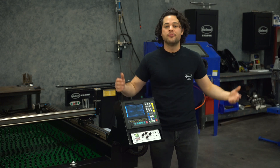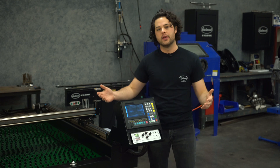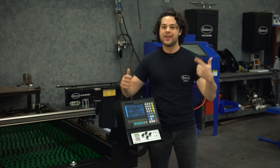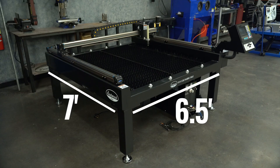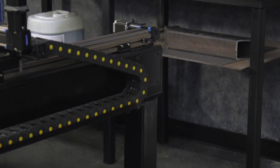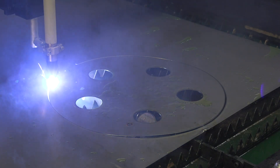The waterbed is also a little generous at 4.9 feet in the X and five-and-a-quarter feet in the Y, so there's some extra room in all directions. Importantly, you can also put a four-by-eight or four-by-ten sheet in this machine — you just have to support the overhang a little bit, and there are even rollers on the edges of the waterbed to make feeding larger sheets easier. Buy your sheet, throw it in, and get to cutting — no trimming required. Overall dimensions are about six-and-a-half by seven feet, which is pretty slim for a machine with this cutting area, and that includes the controller. Down at the bottom, you're getting sturdy four-inch by four-inch legs to keep this machine rock-solid when you're cutting.